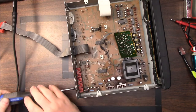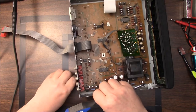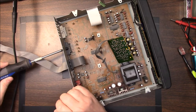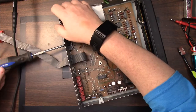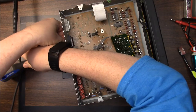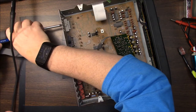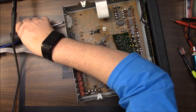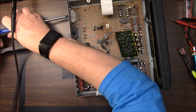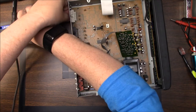Because of this connector here, I don't see any easy way of getting it fully free — but I'm not going to fight it. I can probably put those two screws back. I've got enough cable to hopefully tilt this out to replace those capacitors, which is what we'll do. Let me go ahead and power up my desoldering station and we'll clean this all up.